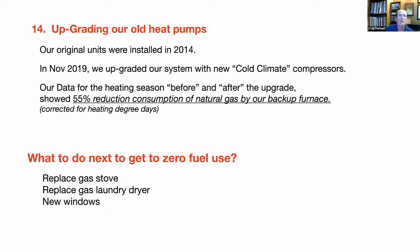I do have one question here. Is a head the same as mini splits? Margaret was talking about heads. Yes. When we talk about mini splits, the air handlers that go either on the floor or on the ceiling or different, those are called the heads. And as I showed in that slide, you can have a compressor running up to three or four heads. And Margaret's installation is a mini split installation. And she's got two compressors, each running multiple heads. And that's exactly what that is.